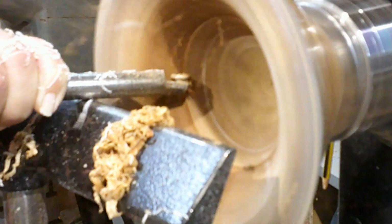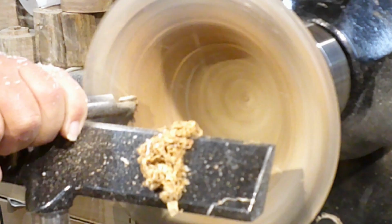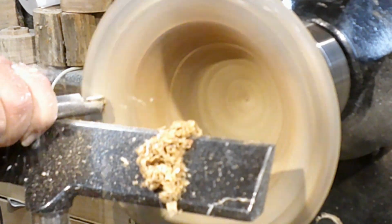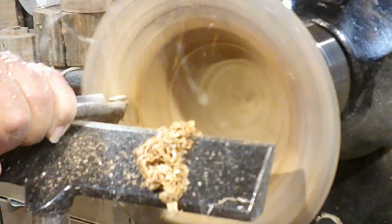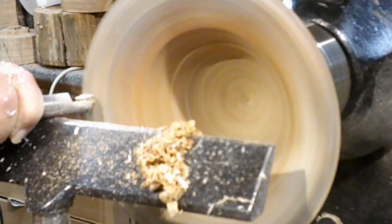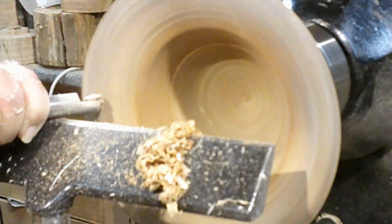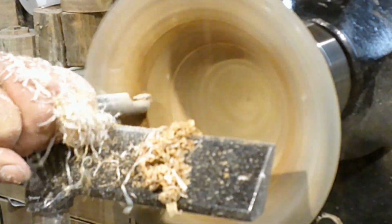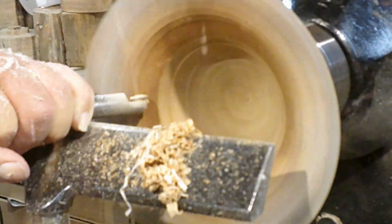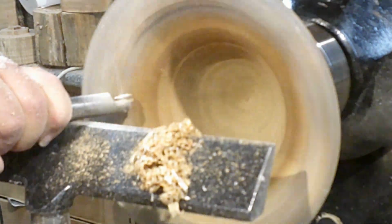And the piece that I'm using at the moment was primarily my hollowing tool. But I find those carbide tip tools do work better on resin. I think it's a negative scraper that does it. They do cut a lot better. You see this is hogging through that wood and that resin, and it doesn't seem to matter what it's cutting, it just rips it all out. So I think what I might do is go online and buy some different shaped carbide tip tools, make myself a little set of tools, because they do work extremely well.